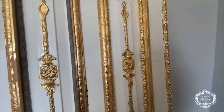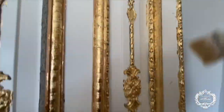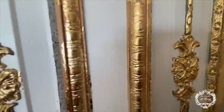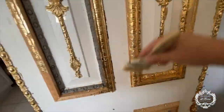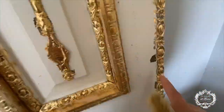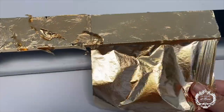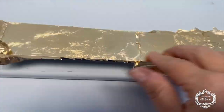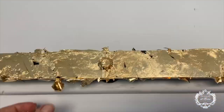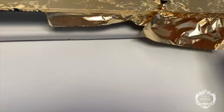Again, this is very freestyle — I didn't have to be perfect. The only thing you'll want to do, which is what I'm doing here, is take a dry brush and knock off all the flecks of gold. It's hard to get them all off, but you want to make sure you get those off so they don't catch in your paint. There I am doing the whole hardware piece up above the door. This went very easily — I just painted on the sizing adhesive up above and laid the gold leaf on there, and it covered beautifully.